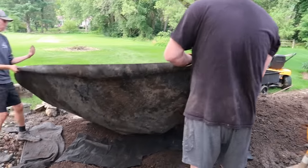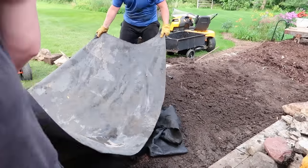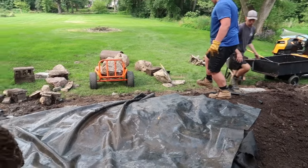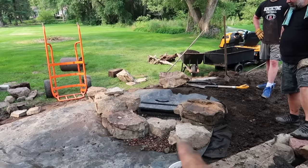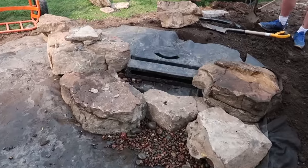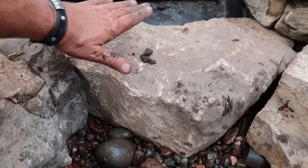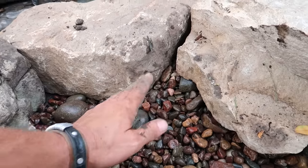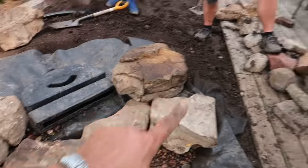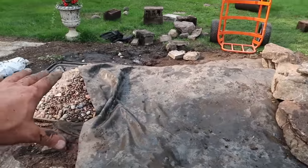We are about 45 to 50 minutes in. We're putting the liner back. The ground's been excavated. We used the little scrap pieces of underlayment that we had, all this nice topsoil. Now we're going to put the spillway in at the top and then start putting in the boulders. So you see our two big frame rocks there — the water's going to come right over here coming down, and that's your main waterfall. You see how different it is than the tall one? The least amount of rocks you can use, the better.